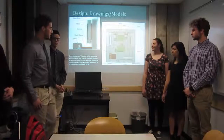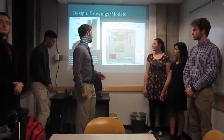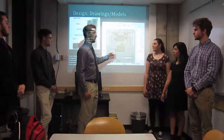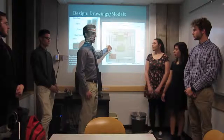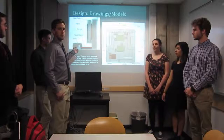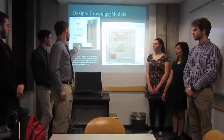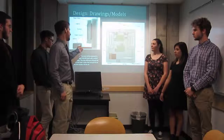For our design, we have a 24 by 24 centimeter square base, and we have all of our required components inside the box. We'll have two compartments on either side where we'll house our mechanism. Our mechanism is comprised of a servo with a gear that will mesh with a gear rail that will push the door open at the specified altitudes.